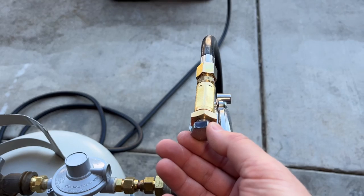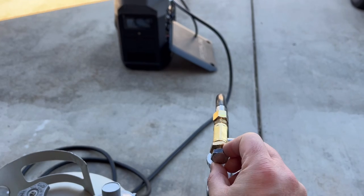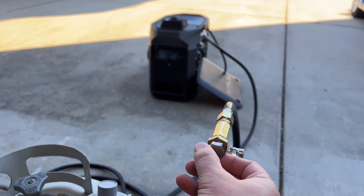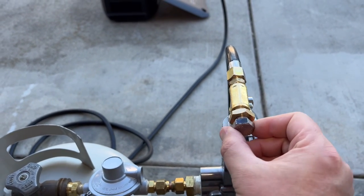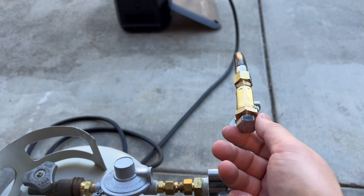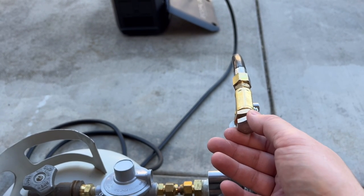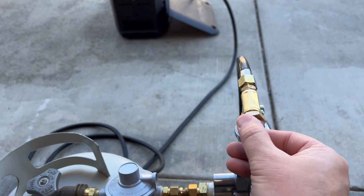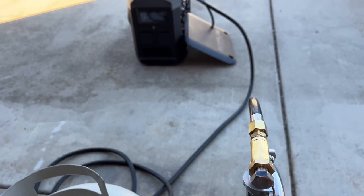While we're here, let's play with the load screw and see what happens — you can hear the engine RPM go up and down as we adjust it. Normally you want to go down then back up to find the sweet spot. We'll get the generator to drop down a little and listen. Then we'll go back and leave it about here for now and set up a proper load to confirm it's running correctly.